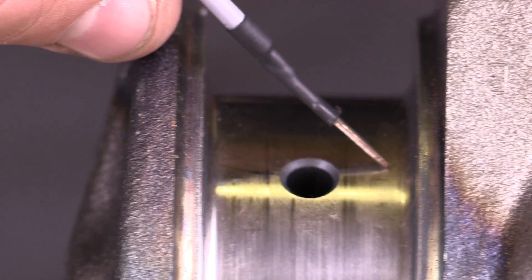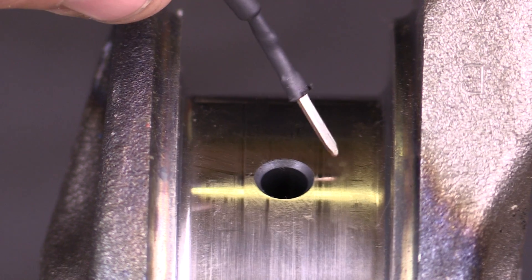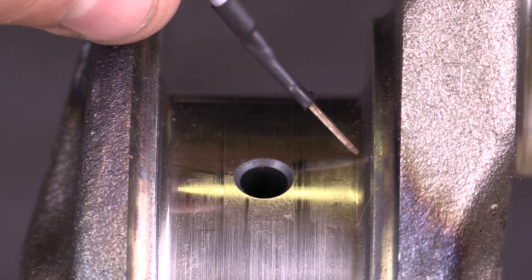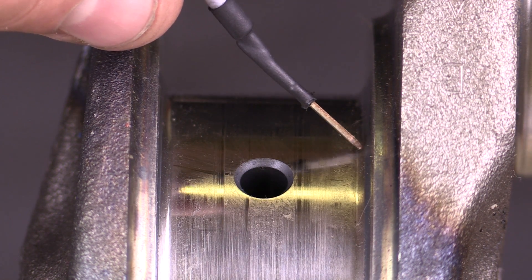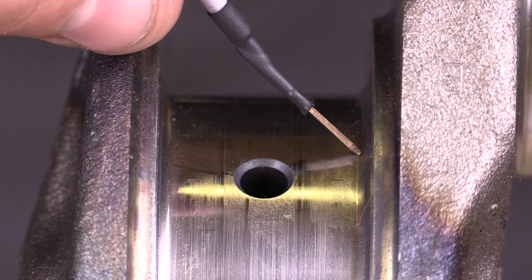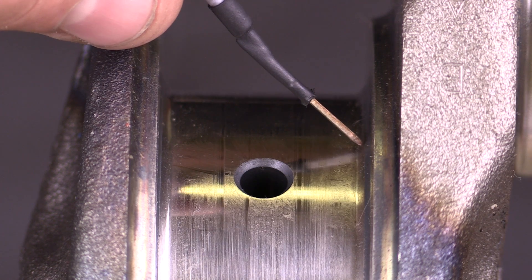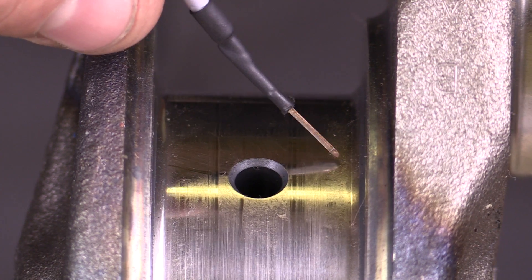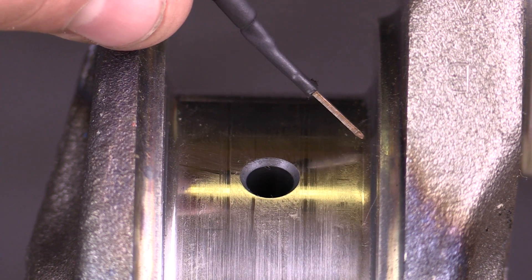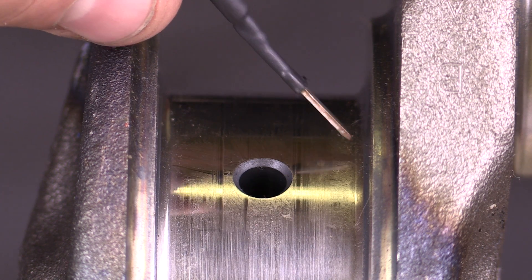If this was a square cut — if it just came to a sharp angle and then came up — I would have significant pressures placed on that edge, and that's where I would most likely see cracking occur, right here at the fillet. So during a visual inspection we want to look right here at the fillet and identify whether or not there's a crack. There are magna-flux techniques that can be utilized for crack detection, but we're not going to talk about those in this video.